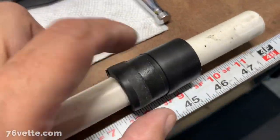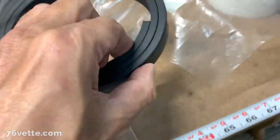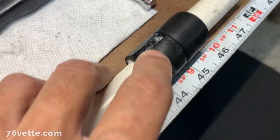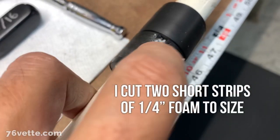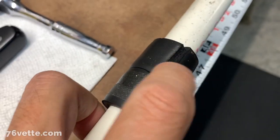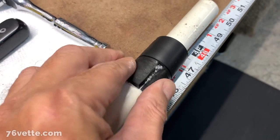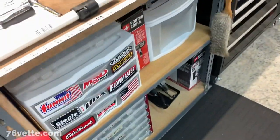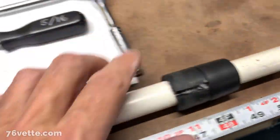I just wanted to give you a close-up of the seal and gasket I made. I had some leftover neoprene — I don't know where it came from, but it's a quarter-inch thick. I used crazy glue to secure it to the PVC pipe. You can see one opening here and the other is opposite, so when you insert the vacuum hose you have a very tight fit with no air loss. I'd recommend using an activator in addition to the crazy glue because it will really make it stick to the PVC.